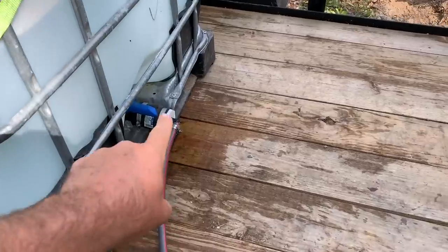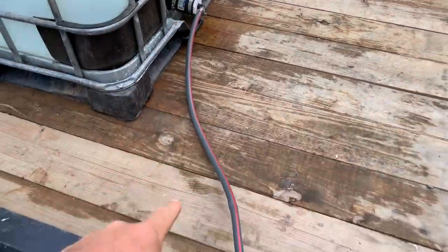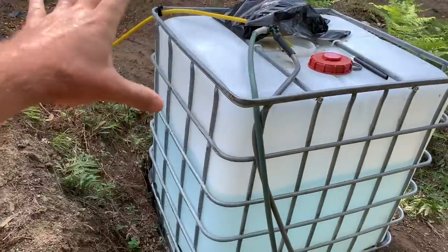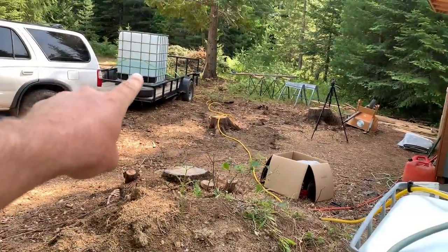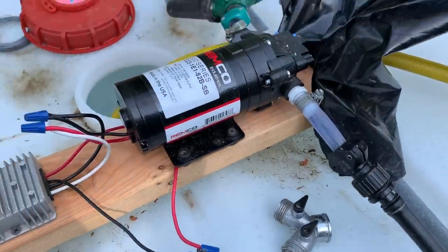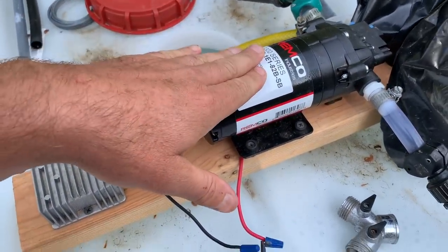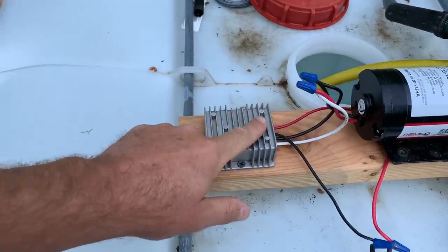We just bring the water home and hook this hose right here onto the valve, connect it up, and run it over to the tank that we have our pump on — that provides our homestead with water. Gravity will feed most of that water into this tank, but not all of it. This is our water pump. It does 2.2 gallons per minute and uses 12 volts. Our solar system is 24 volts, so we use this little converter right here — got it off Amazon, super cheap, but it has been working great.